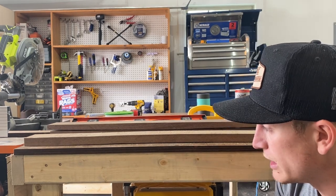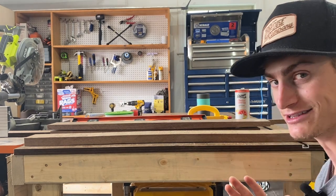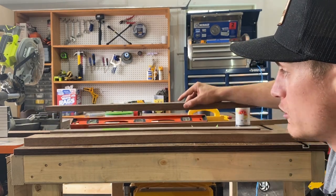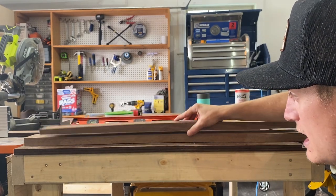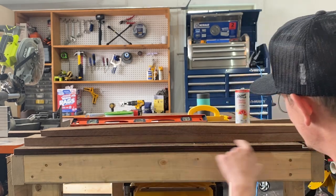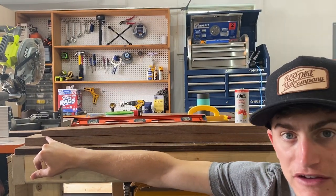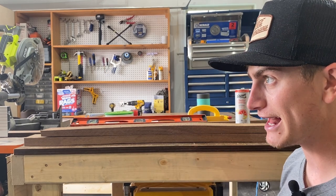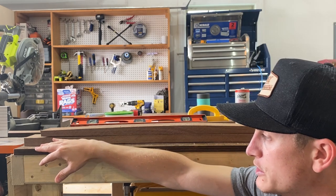For my 30 and 3/8-inch board I started with a 32-inch board, giving me about an inch of error on each side. I'm not sure if it was my technique or my jointer setup — probably a combination of both. After joining the board, instead of correcting the bow, I ended up with tapered ends: the sides got too thin, measuring already at about half an inch thick in places. Since I need at least three-quarters, this board was unusable. You can always take more off, but you can't take less.